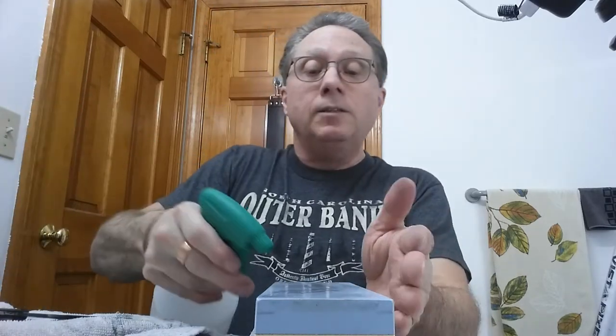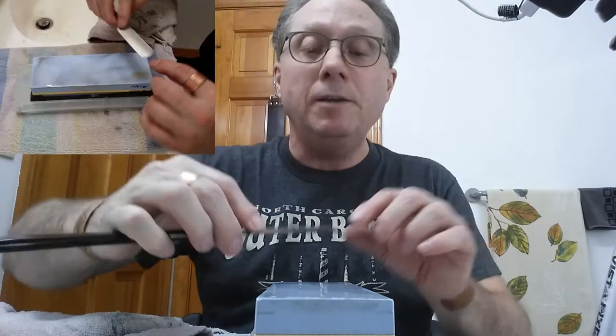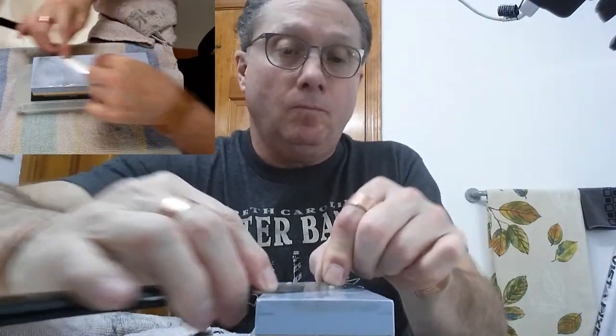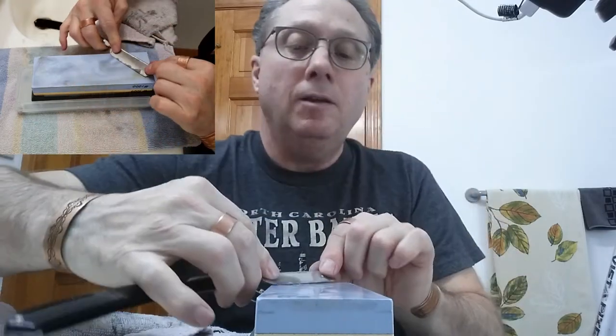This is probably another good time to give a shout out to the Stallion — this is where I learned how to hone in this manner. It's super simple and it doesn't take a rocket scientist; anybody can do this. Let's get that stone wet again and finish this up. I think we'll just about have a bevel set. Let's do 10, 10, 10, 10 — then 12, five, five, five — now X strokes.